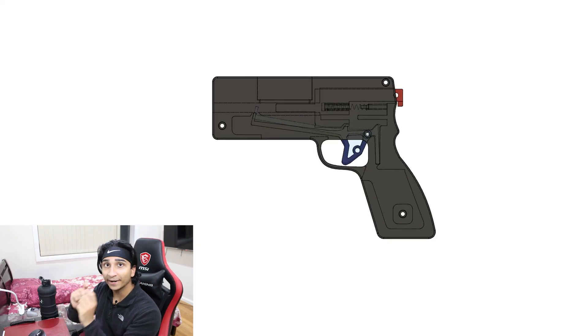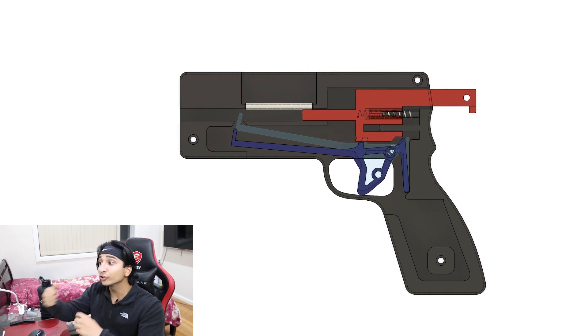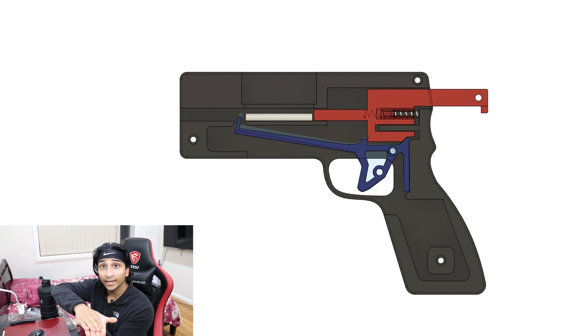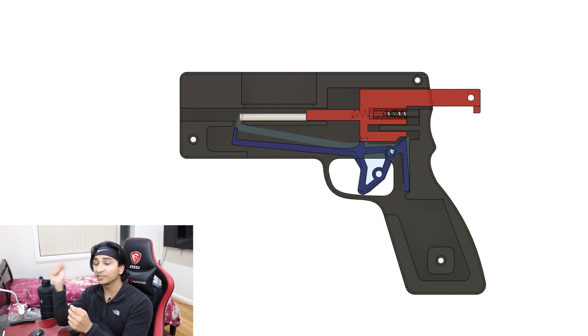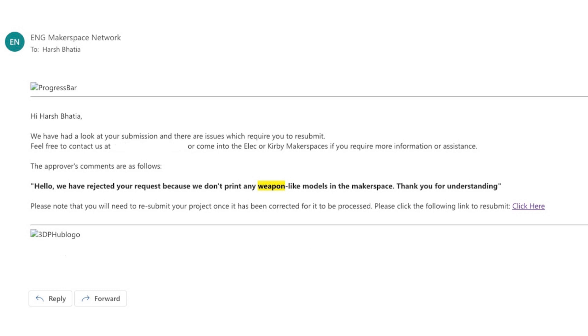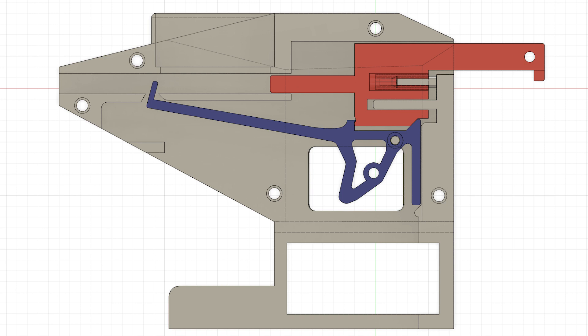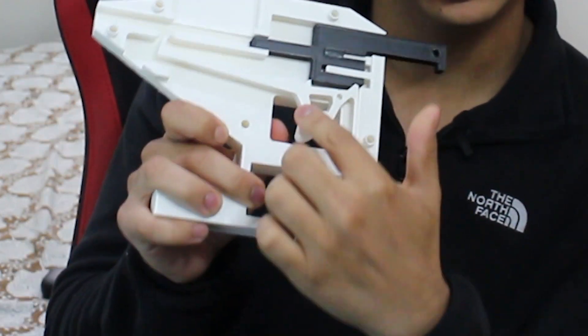The mechanism is powered by a spring. The spring contracts when you pull the piston back — it's kind of like a nerf gun when you cock it back. The trigger goes up and holds the spring in place, and once you pull the trigger the spring shoots out, launching the straw. My 3D print got rejected because the gun looked like a weapon, so I told them I was making a hot glue gun and that worked. We've got the spring, the piston which pulls back and locks in place with the trigger. The servo motor pulls back the piston and also pulls the trigger to shoot.